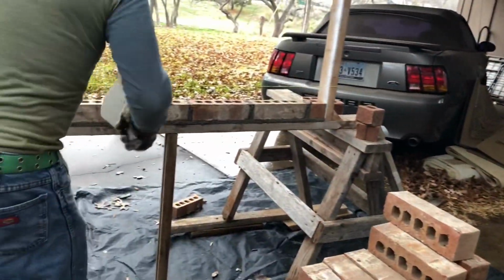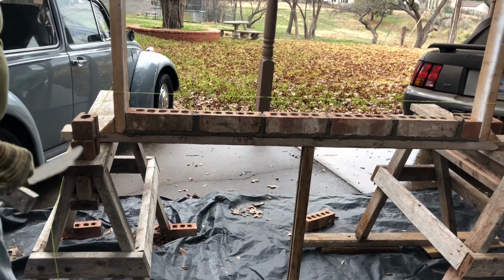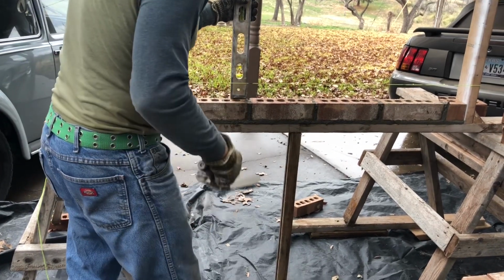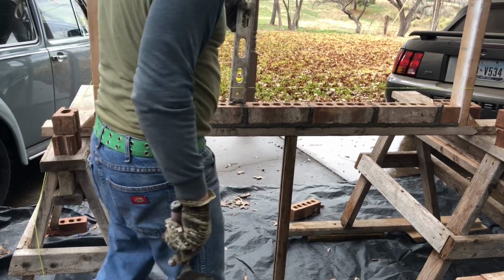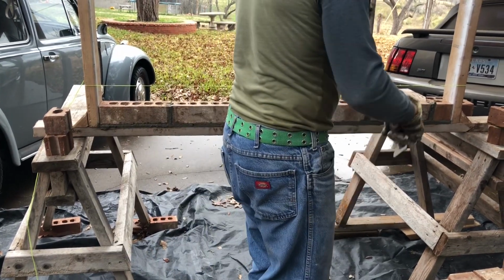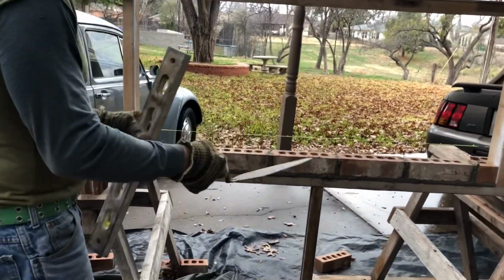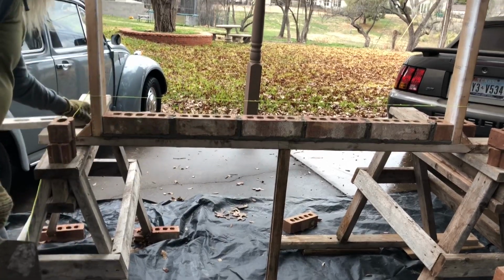Right now would be a good time. There's always a backing on your house. The existing house, there's always a backing here. But you can take your level, and every third or fourth brick, right there, make a mark on your house. Go another 3 or 4 brick, and do the same thing. That way you have a mark to look at, and you can kind of stay with them once you get this one the way you want it. Now, here we go.